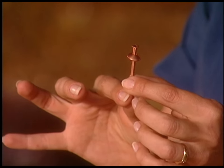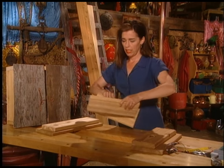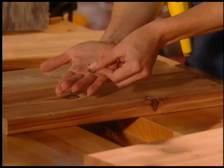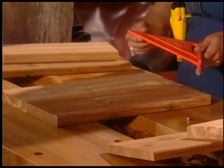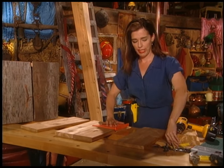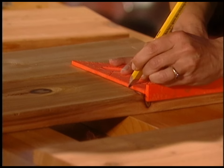And if you use fancy little nails like this — little copper nail — it looks so attractive. So the next trick is to line up the two side pieces and drill the holes for these little shelf bracket pins. You can make as many adjustable heights as you want, all the way from top to bottom like those prefabricated shelves that you buy. So let's say my products are generally about this high — I'll set them in roughly an inch and a half.